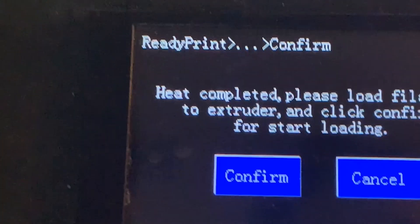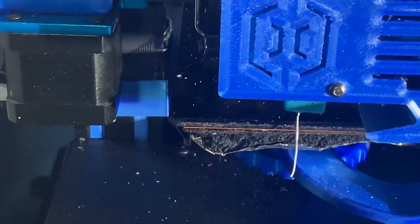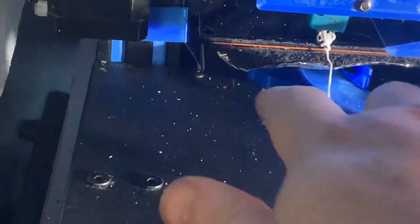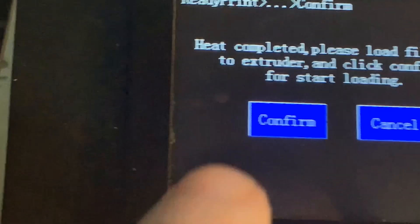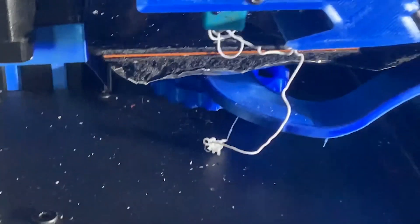I reinserted the filament, now I'm going to do the preheat and confirm it. You can see it actually clearing out the remnants of what's left over — and we have filament coming through. I'll do it again just to make sure it's cleared out, because you saw it curled up towards the nozzle. I want to make sure I get a clean, nice steady stream coming out so it's not clogging up on the plate. That's how it should look — starting to come down and not kinking up.